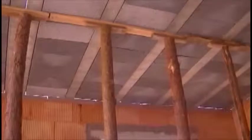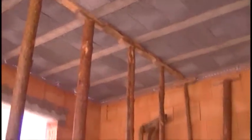Here you can see the underpinning process. To do it properly, we will use long boards, which we set perpendicular to the ceiling beams, then beneath each of them put a wooden stamp. It looks more or less like you can see in the film. Such boards we will place at a spacing of 1.5 meters, while the stamps stand every 60 centimeters, exactly as the beams are placed.